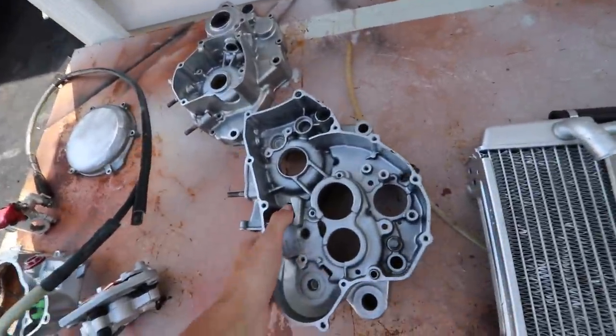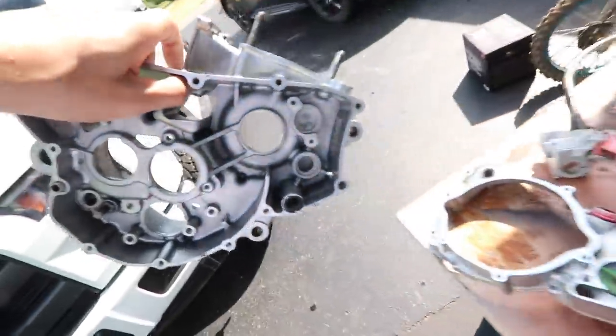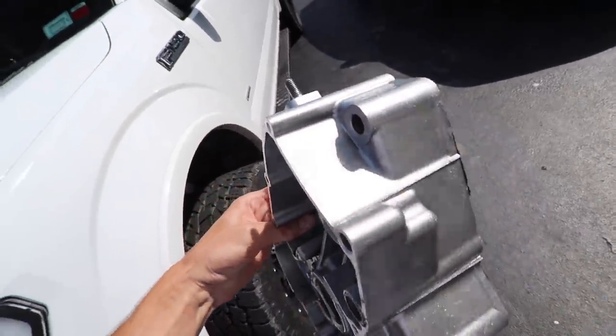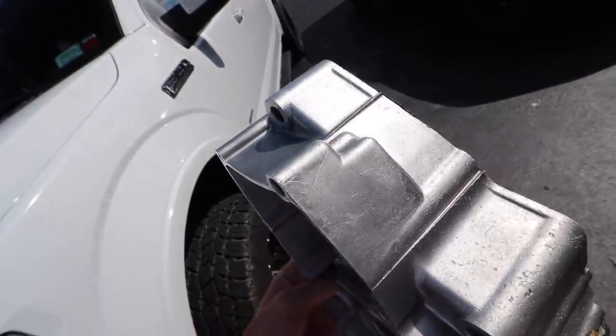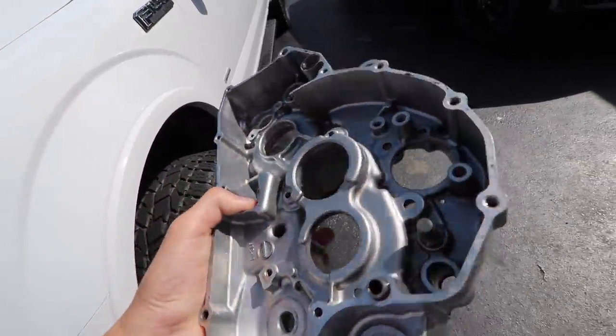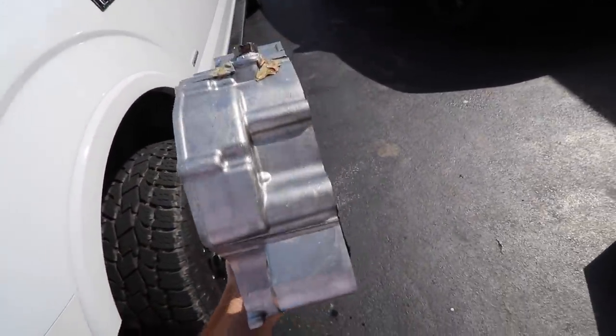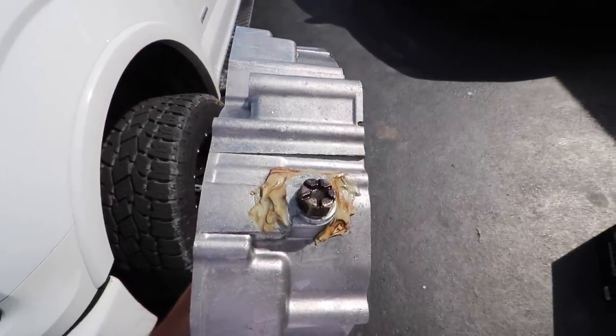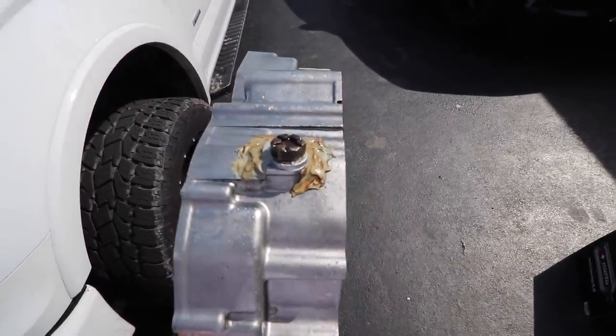Here's the first look — kind of not fully finished, but pretty much all the bulk of the stuff is off. Get a good idea in the sun here — it literally took all that dirt and grime off. Take a little more time to get more stuff out of the insides. I've also got to get that JB weld off — grind that off or pry it off, heat it up or something, and then vapor hone that part.